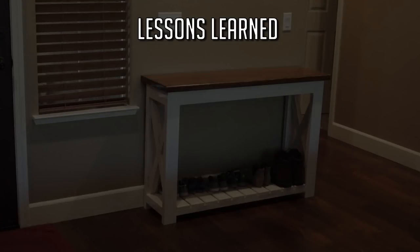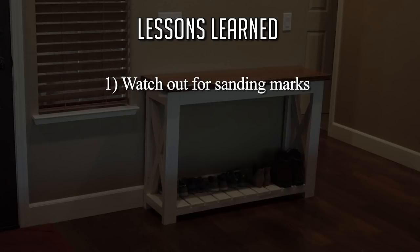For the lessons learned segment of this video, I have 4 tips that I picked up throughout the project that I'll share with you. Number 1, when you're using a random orbital sander like I was, be careful about how much pressure you put on the end or the edges of the sander. There were a few marks in the top that I didn't notice until after the stain and poly. They're not horrible, but they're noticeable to me, so be careful with the sanders.